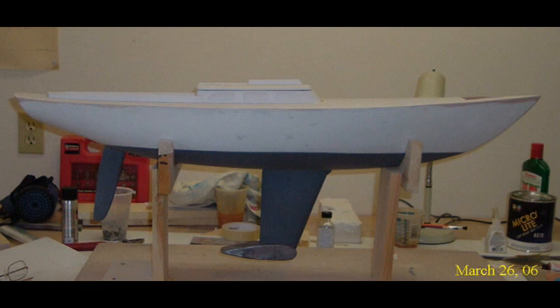In order to determine just how big I should make the keel and rudder, I calculated the wind loading that would be required to bring the boat up to hull speed. That determined that this boat, unless I put a really radical keel on it, is not going to be able to sail in winds much more than about eight to ten knots, and that wind speed will take the boat right up to its hull speed — maybe a little bit beyond — and any more wind than that will simply heel the boat.